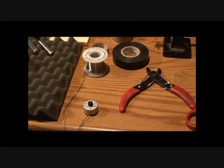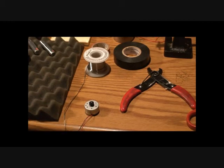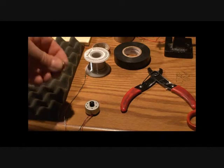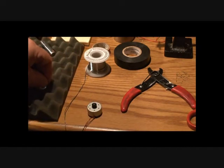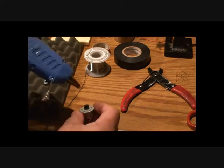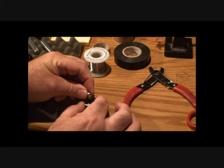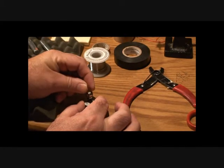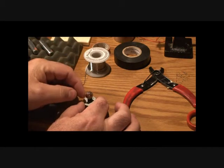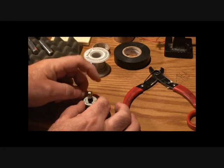One of the most important parts is mounting the magnet to the motor. Get a motor that either has a spindle already on it or a mount combination that will support the magnet. The magnets are very strong, so you'll have to work carefully to get it on straight — if it's not on straight, it will wobble around inside, make a lot of noise, and possibly come off. First, get it mounted as straight as you can on the end of the spindle. Put a little hot glue on there and hold it for a few seconds, getting it as straight as possible.